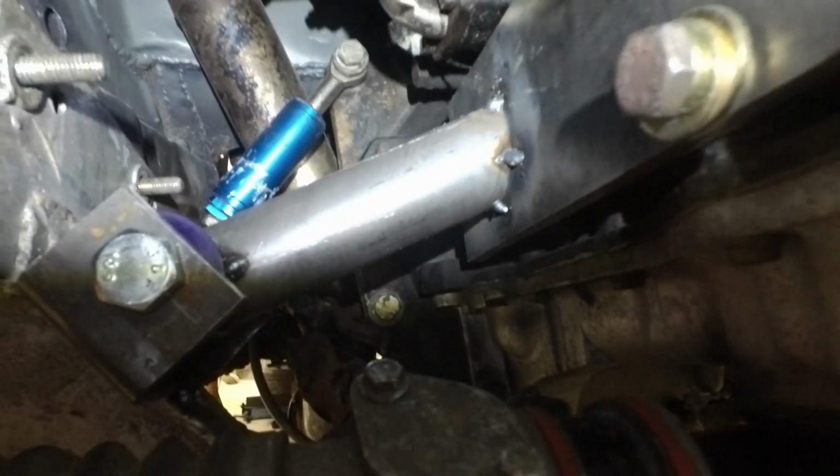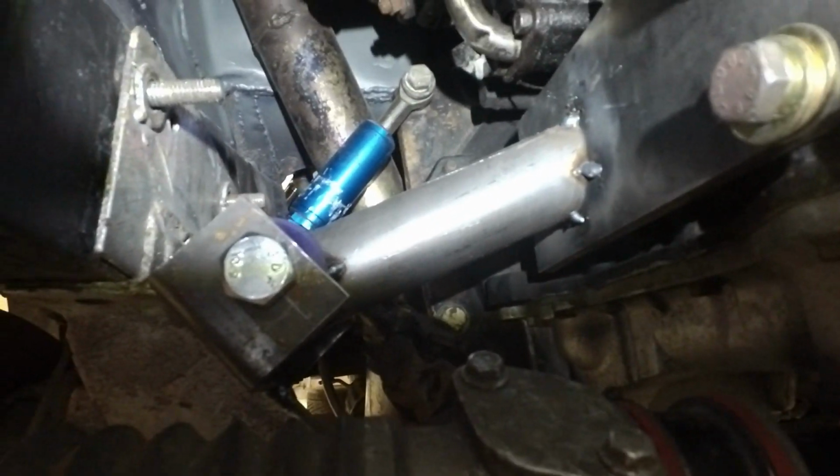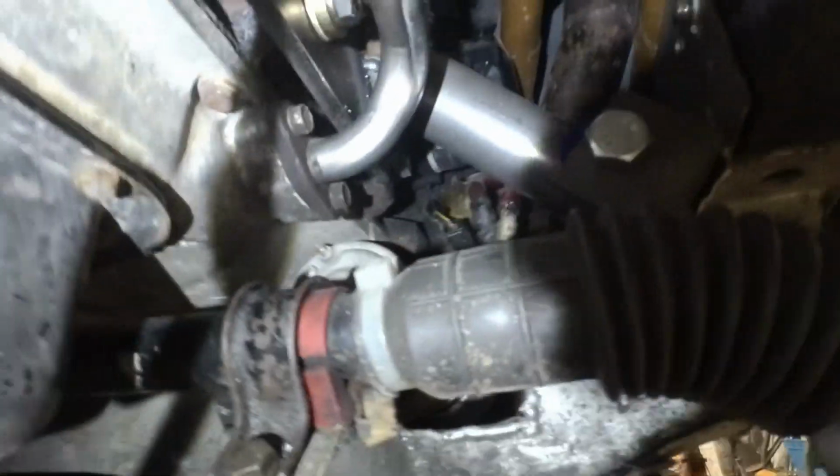So we have driver's side and put some lights over, and passenger side. So what I'm going to do now is pull the crossmember off again, which should hopefully just slide straight down, and then I can remove those plates from the engine, fully weld it up once I've taken out the poly bushes, of course, so that I don't burn them in, and finish zapping on the bracket onto the crossmember, and then it should be nice and solid and it can go back in place.